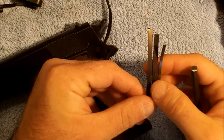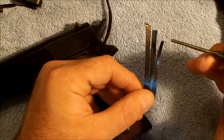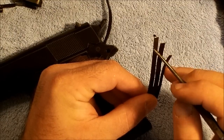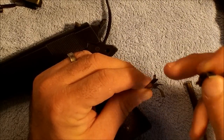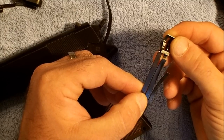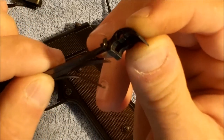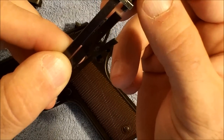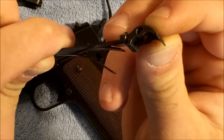The way this spring works is it sets in the pistol and gets its spring tension by being compressed by the mainspring housing, which comes up over the top of it. This first leg of the sear spring is what controls the actual sear itself. You'll notice it's got this notch on it and it will actually set on the sear in this configuration here — that's how it would engage on the sear itself.